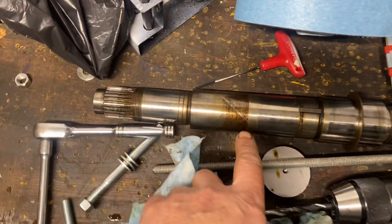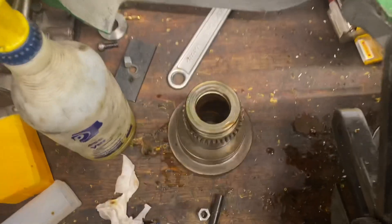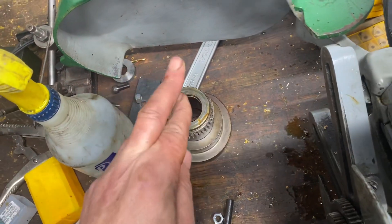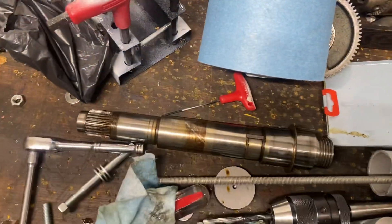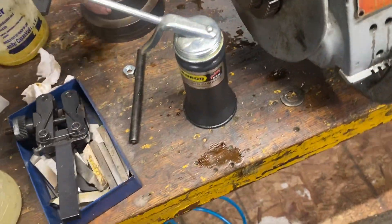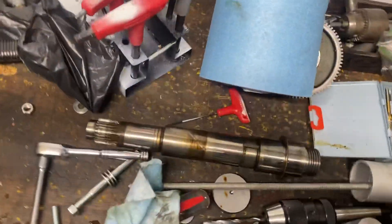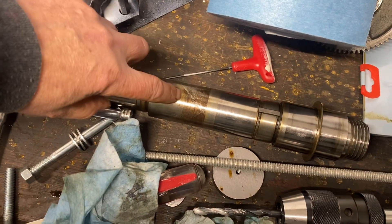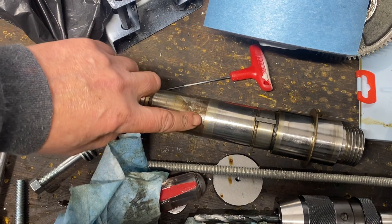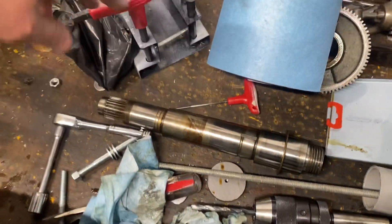There's a little bit of surface rust, and look at this — you can see the X pattern. This is where the pulley rides, and if you look inside the pulley, for the oiling it's got an X — basically a crossed X pattern for delivering oil. There's a little screw on the top that actually says 'oil' — you're supposed to keep that oiled. So at some point this sat long enough for a little bit of surface rust to form, and you can actually see where that cross was. But the part I'm concerned about is where the bearings ride, and both of those are absolutely pristine.